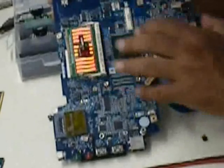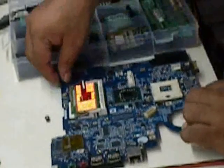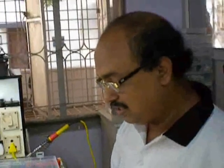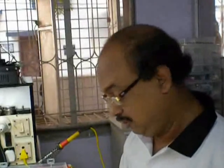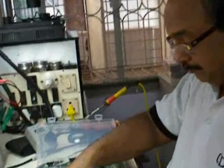This particular test socket helps you find out whether any dry solder cases are there in between. Many times what happens is we insert the RAM and a RAM beep comes out, and we are not sure whether it's a power related problem or a problem related to the connectivity between the data, the address and the control signals. Once all the LEDs are glowing, you can always say that yes, your data and address connections are all okay. So this is also a very good tester.